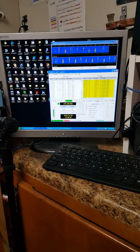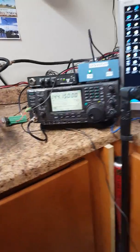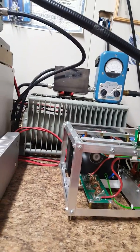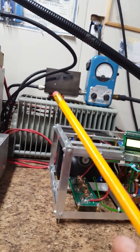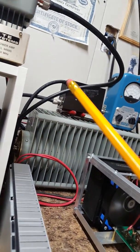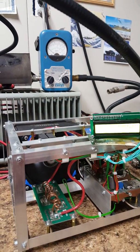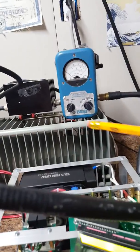We'll key up in the normal fashion I'd probably be using this amplifier, going through my keying and switching boxes into the radio. The radio provides close to 100 watts out on 2 meters. This is a 25-watt input amplifier for 1,000 watts out, so to idiot-proof it for myself while learning, I put a Decibel Products 100-watt 3 dB attenuator in-line, bi-directional, followed up with a standard Bird 4304 on the 150-watt scale.